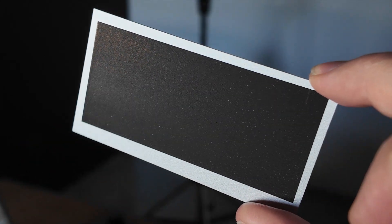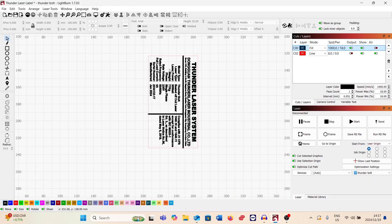With the text it's not a solid black block, so you can get away with bi-directional — I didn't see any real change in the quality of the outcome. Also, if you're going to do a whole batch of these you don't want to use unidirectional; it's going to take far too long. The airflow might affect it slightly, so you might want to position them — maybe three going across — depending on how fickle the material is.